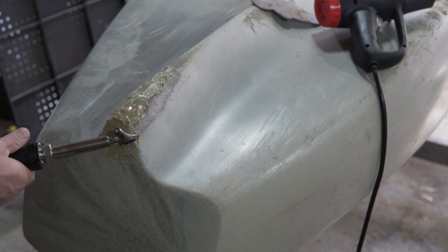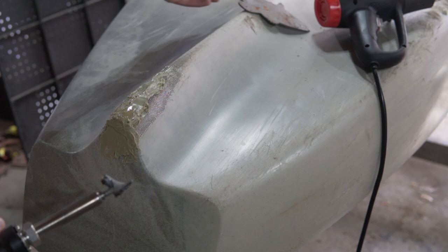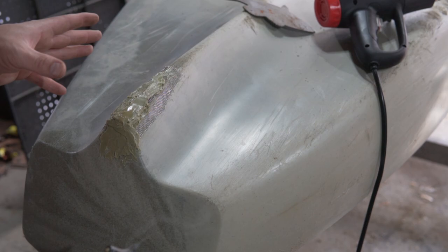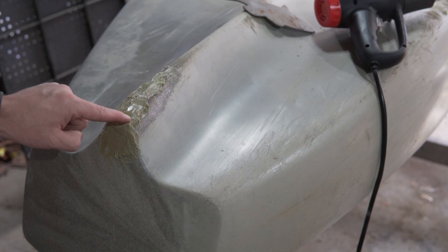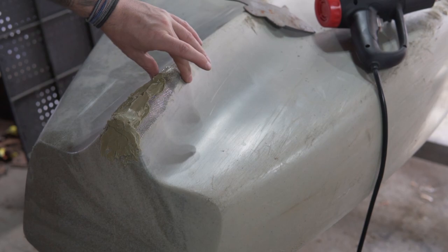The final smoothing of all this will be done with the heat gun and a putty knife, butter knife, or my trusty metal fish — a nice flat surface with a heat gun — and I'll be able to smooth and shape this all out. But we've got to finish building up more plastic first. I want to raise this keel up a little bit more, and then smooth out around the screen. I want to put plastic all the way around here and reinforce this entire keel, keep going until the whole screen is covered with new plastic. Then I'll use a heat gun, smooth it all out, and we'll be able to take this thing out on the water.